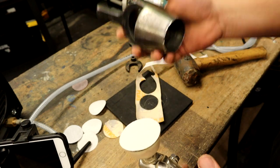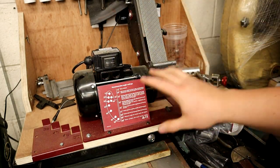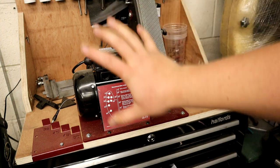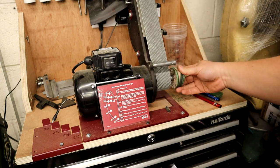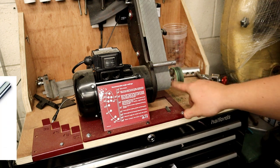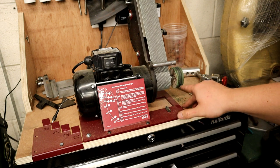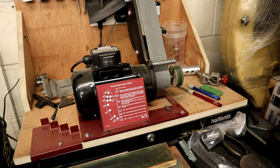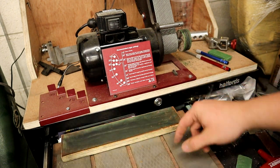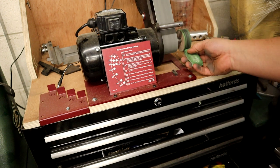I'll run very quickly through the sharpening and show you what I do — it's probably not the best way but it's how I do it. Ignore the fact that this is a Pro Edge grinder. The important thing is this little part here — just some leather I've cut out with a scalpel, mounted on a pigtail mandrel. You can get these for a standard bench grinder with polishing mops, or you can strop by hand. I'm putting a little bit of rouge on it.